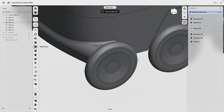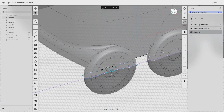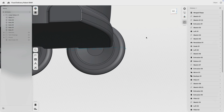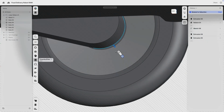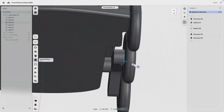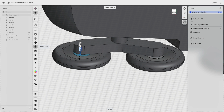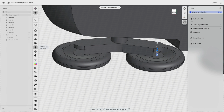Cool. Okay, I realized I need to do one thing. So inside this sketch, that has to be 2 inches, because that is 2 inch, that is 2 inch, and hey, here that arc is 2 inch too. Beautiful. So we can select then these two flat inner faces. That's the reason why I kept those not filleted. Go extrude and extrude them in.